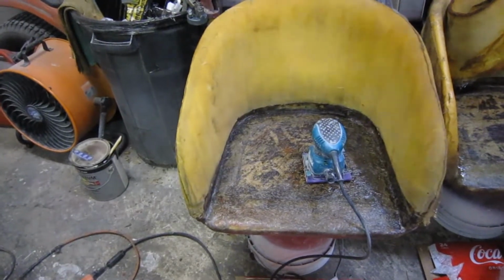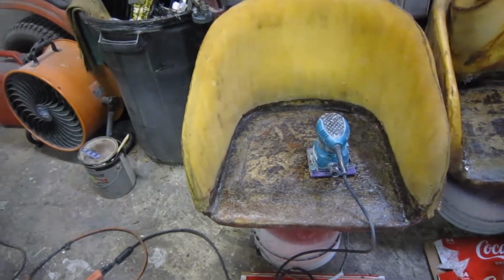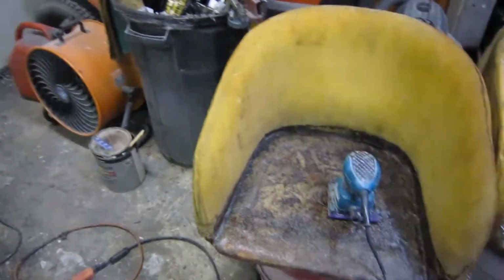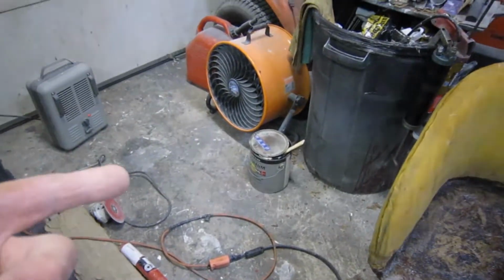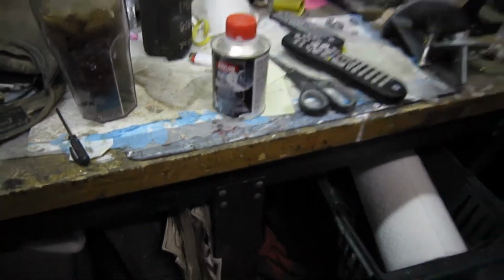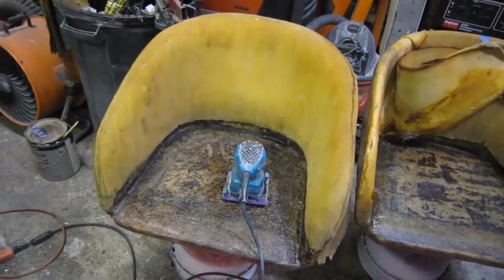But there are areas that will be exposed at certain times during its lifetime, and those areas have to be painted. And where I'm at right now, it wouldn't matter if I spray painted them or got out my gallon of Rust-Oleum black like I have, and my Krylon farm implement catalyst acrylic hardener. It's just a hardener for the acrylics, like I said before. It's something that you add to oil-based paint, and it makes it go off like a two-part.